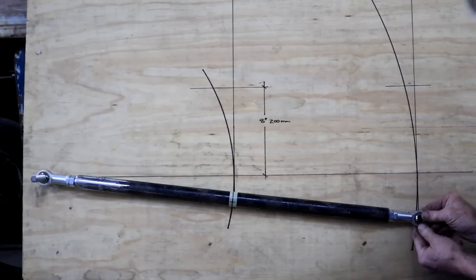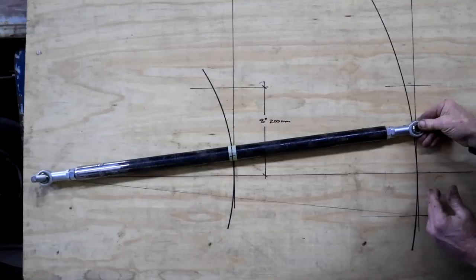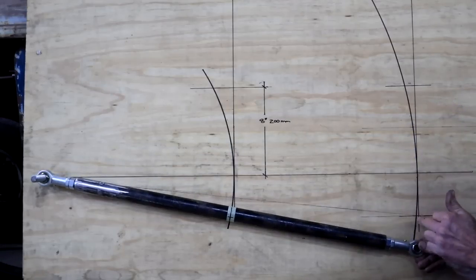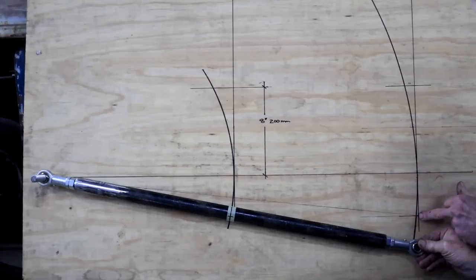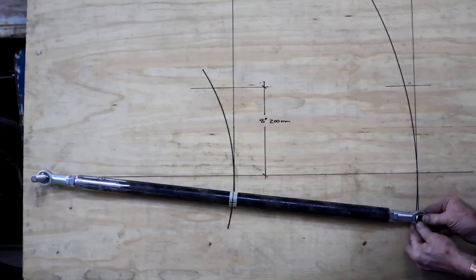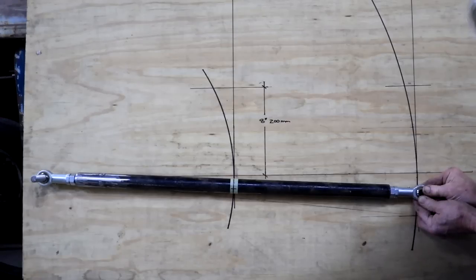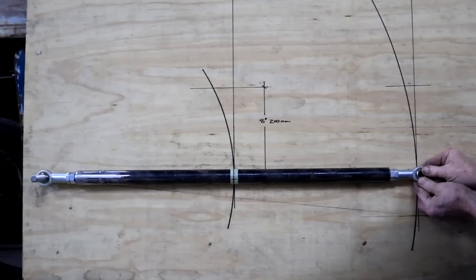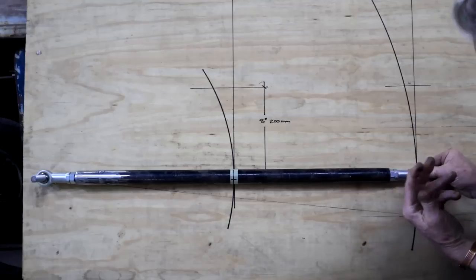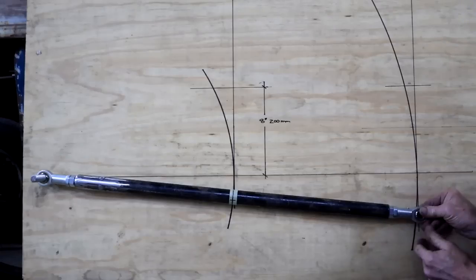But the one benefit I do see of this is the change in the fore and aft movement of my back axle is actually quite minimal. Maybe you can see it there. It's only, I wonder if it's 1/4 inch. There and 1/4 inch there, if that much. If I sit with a 6-inch ground clearance, I'm going to be sitting around there. And then with a 4-inch ground clearance, I will be perfectly horizontal. I now really need to make up my mind about this design ride height angle and whether I should drop that bracket more or not.